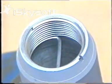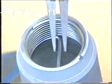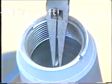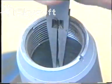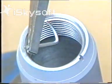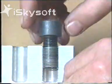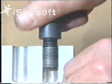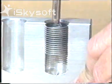On larger inserts, it's impractical to use a TBO, due to its size and weight. It is possible to get hold of the tang with a pair of long-nosed pliers. Hold the tang and agitate it up and down — the tang will fracture at the notch. Tangs should be removed before inserting screws to avoid damage. Stainless steel tangs can be removed by using a magnet.